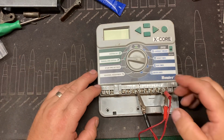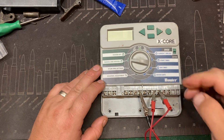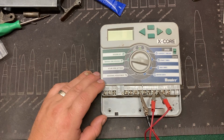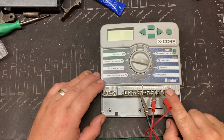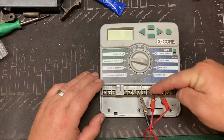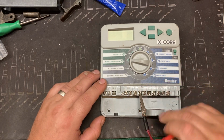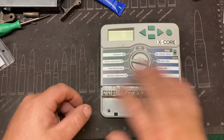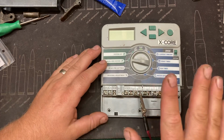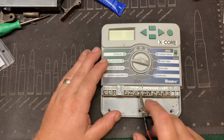So then if that switches, now I'm cutting down my time significantly. Like if I was doing 2 minutes of zone, it would be 12 minutes, but I'm doing it in 4 minutes. I'm doing it in a third of the time. And then I'm going through all of my last cycle to make sure, I'm doing my 1 minute zone and everything's clear. A third of the time the first time through. Significant, especially on bigger systems and bigger zones.